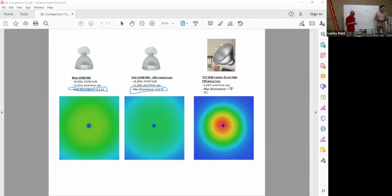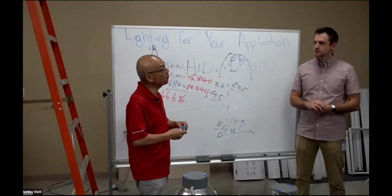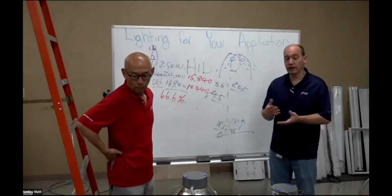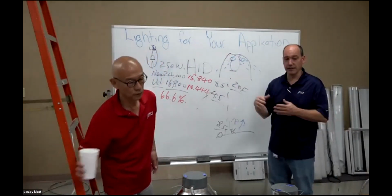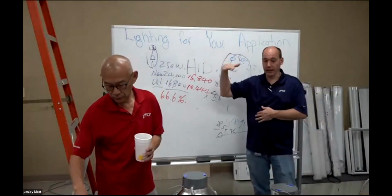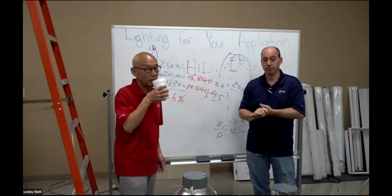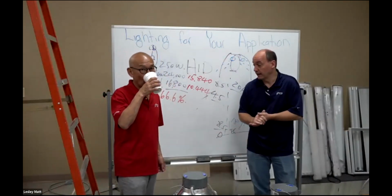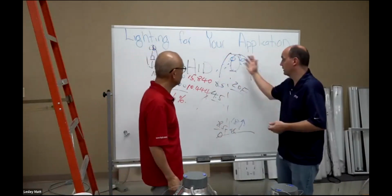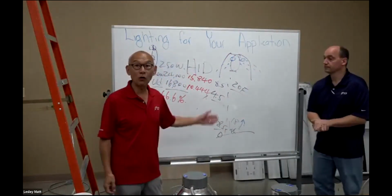And now we're just talking about the light. We didn't even talk about the color changing that goes on. Would you tell people a little bit about color changes, Paul? Sure. That's the problem with metal halide. As the bulb gets older, it might start out looking like really nice, crisp white light, but as time goes on, that color is going to change. Metal halide is not going to look crisp white anymore. It's going to start to get greenish and all those other colors are going to bleed in. It's going to look very, very bad. Very poor lighting then. Right. Okay, so that's what happened.